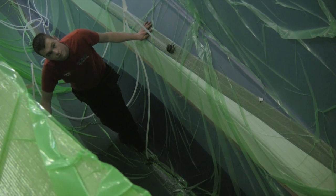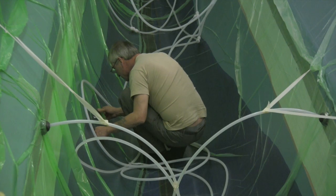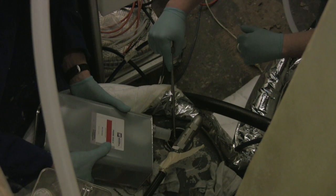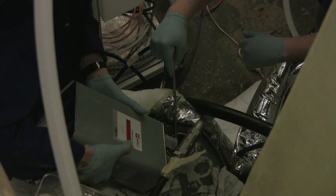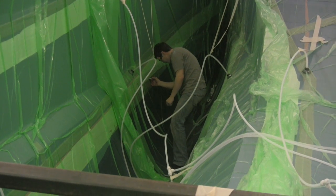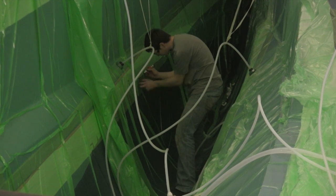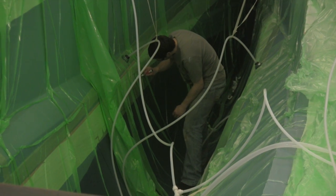The pressure of the resin is greater than the vacuum pressure — the atmospheric pressure on the bag. I just want to see what speed we're doing through the resin front. You just need to keep marking it every 20 minutes, half an hour — put the time on it, 24-hour clock.